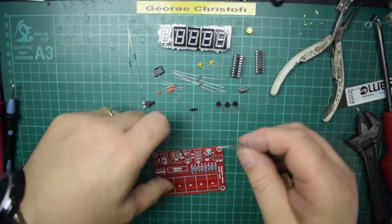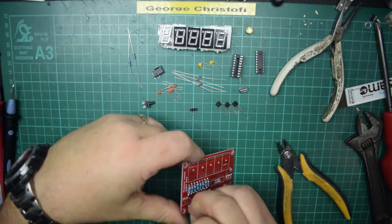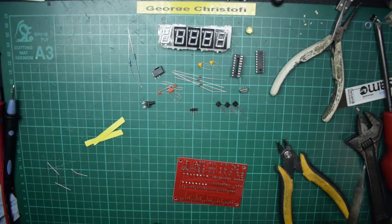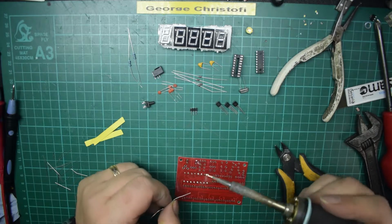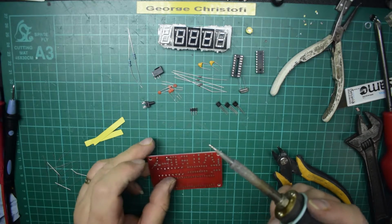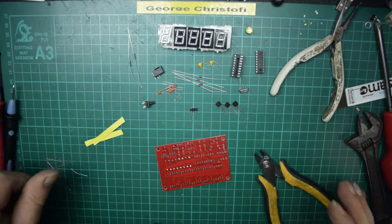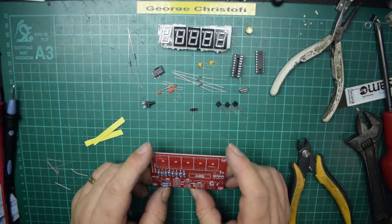Learning the resistor colour code, again, you can do it. There are rhymes out there. The one I learnt when I learnt resistor colour codes is not suitable for anybody politically correct. I can't remember the politically correct version, so I'm not even going to try. But the colours all follow the same format, whether it be on resistors or even ribbon cables, which are marked in the same order. If you get a piece of the old computer ribbon cable, that's just marked literally as 0 to 9, and is very, very straightforward.